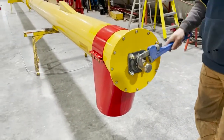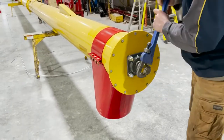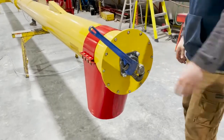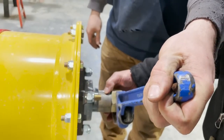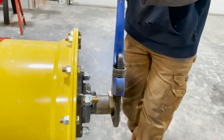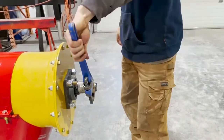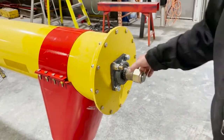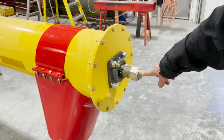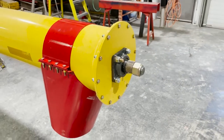He's tightened this lock adjust nut and now he's going to back it off, just so that the nut is just loose. Now we're going to give it two revolutions. Two revolutions should normally be enough. If you had a longer auger — this is a 74 that we're working on — you could go two and a half for an 84, maybe three for a 94, a little longer with a few more joints. But two revolutions generally is good, so we've tightened it up to where we want it.